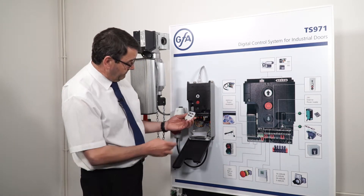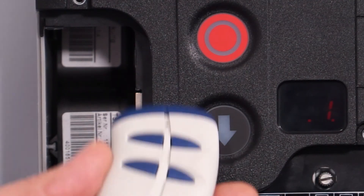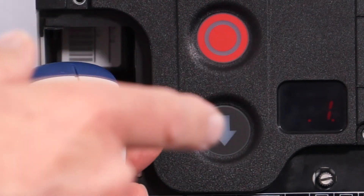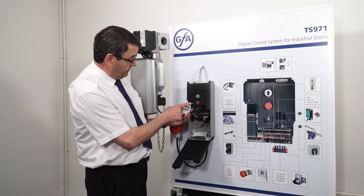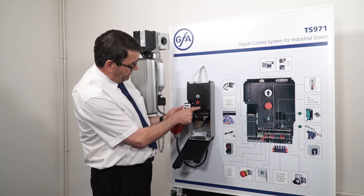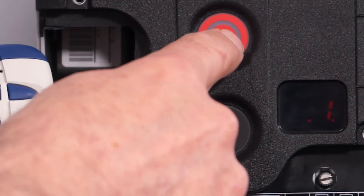On 7.7 we now push the button in again and this time it comes up with a 1. To start the programming procedure, press the stop button in and you will see that the left-hand screen has a line that starts to rotate around the screen.